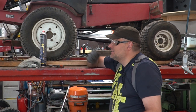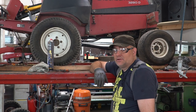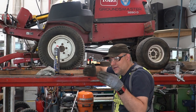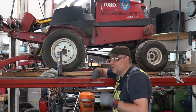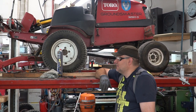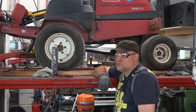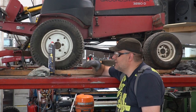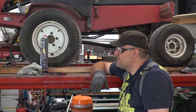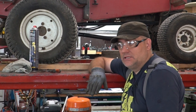So steering is really rough. Only thing that is happening is via the Orbitrol itself. You can turn the rotator or change the steering angle, but you have to do all the work with your muscles. And for lifting up the cutting unit, it doesn't have enough force. It's having some force, but not clearly enough. So there's some problem with the hydraulics with this unit.